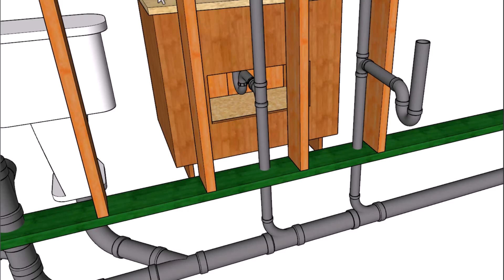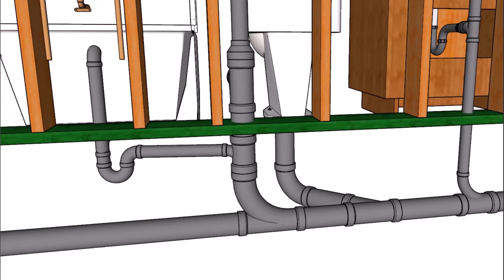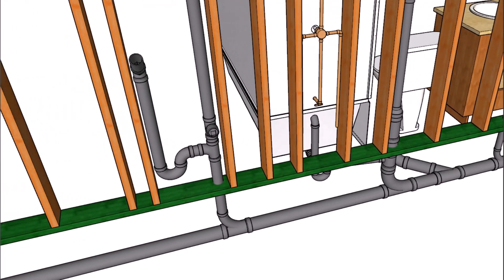You're probably not going to be able to use this example in a load bearing wall situation. So we are going to have a wet vent from here to here. Even though this doesn't need to be three inches, I pulled this example from another one of my videos where this just came down and went this way. We didn't have this section attached to the plumbing, and we used this clean out for the end of the line clean out.